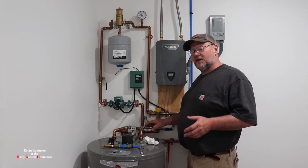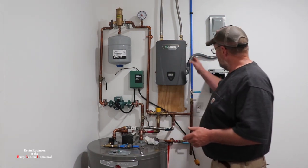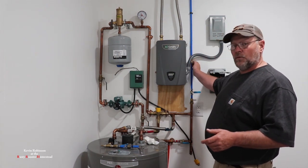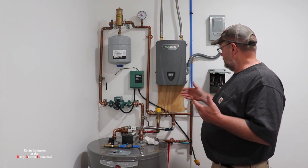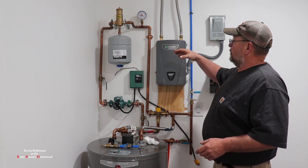What I'm doing now is just getting everything filled up. We have our line hooked in and we do have a one-way valve here, so only water can go into the system — it can't go back into our drinking water.